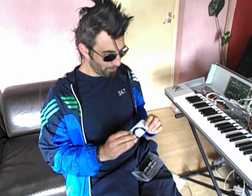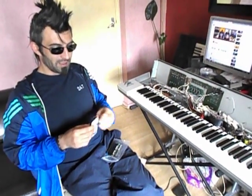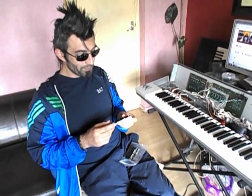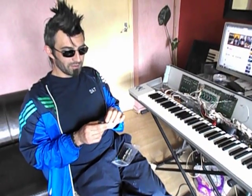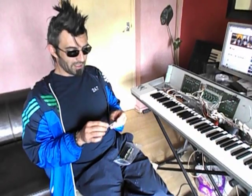I'll remove this shield. I tried everything with the Nano, but I couldn't get the communication right. The Nano wasn't communicating properly — you couldn't get MIDI playing at 31,250 baud. I don't know why; probably the frequency at 31,250 is just not communicating at that rate.